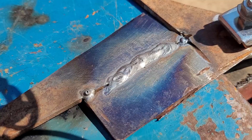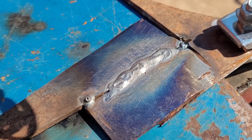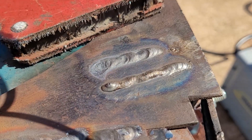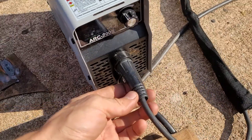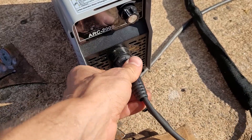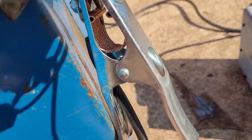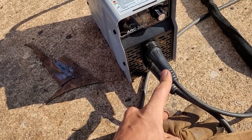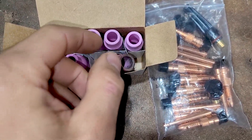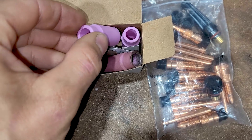We got about 100 amps. Here's the best weld I can get out of it. Blame the welder, not the welder — like I said, I'm not that great at TIG welding, but the machine does great. There's a nice looking little bead I got out of it. There's another nice looking bead. So when you're doing TIG with this thing, you've got to make sure that your electrode is negative and the ground is positive. So the ground electrode is on the bottom and the torch is on the top. On the TIG cups, I experimented with a couple of them — I tried a number 7 and a number 5 and 6, but I settled with the number 6. It seemed to do a pretty good job.